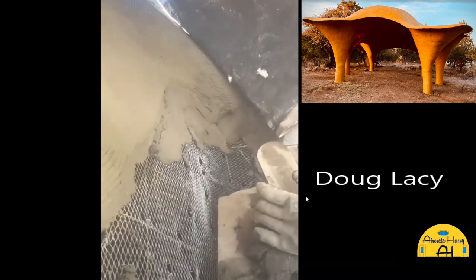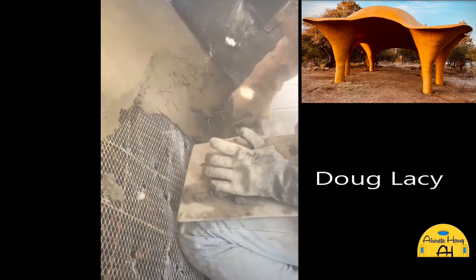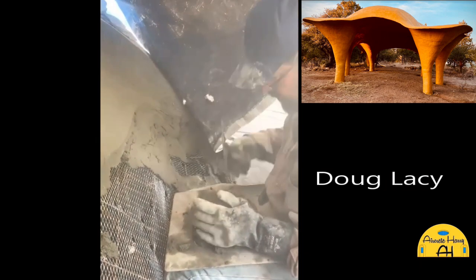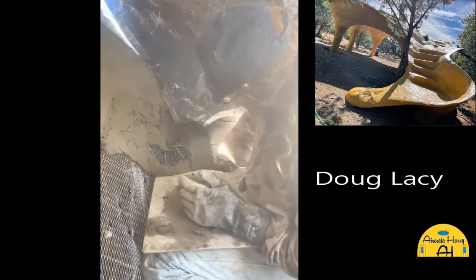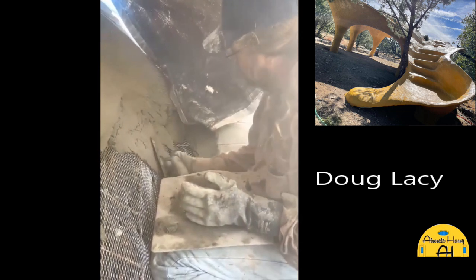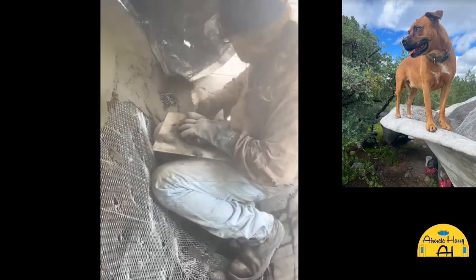And here I'm connecting the stress skin hollow core to the single shell awning that provides its lateral reinforcing. And I'm just showing how to embed right here. This is the embedding layer. So I'm just plastering off the tip of my trowel like a beginner, and that's kind of necessary, so you're not wasting the cement by pushing too much through, but you're pushing enough through to get that really good bond. And that's just like a super thin layer. And then as soon as I'm finished putting that super thin layer on, I follow up. And I think I talk a little bit about making the cold joint.